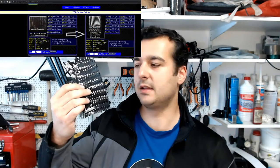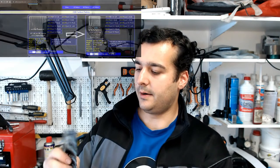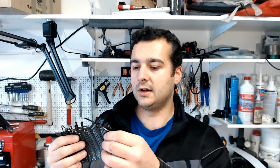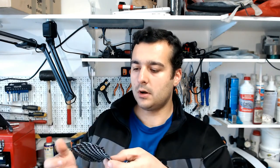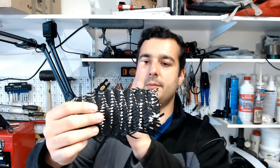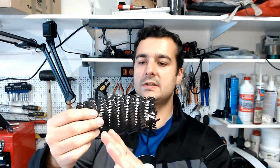Now, while that is interesting, there's more to composites. This fabric is really different — it's a very different kind of animal, and you don't find it in many places. This is a triaxial fabric made by ANP. It's only slightly different based on the manufacturing process from the plain fabric — because this has not been woven, it has been braided. The machinery is a little different, but still the physical realization is pretty much the same. You can see it has a triangular pattern meaning there are three different fiber directions: 0, +60, and -60.